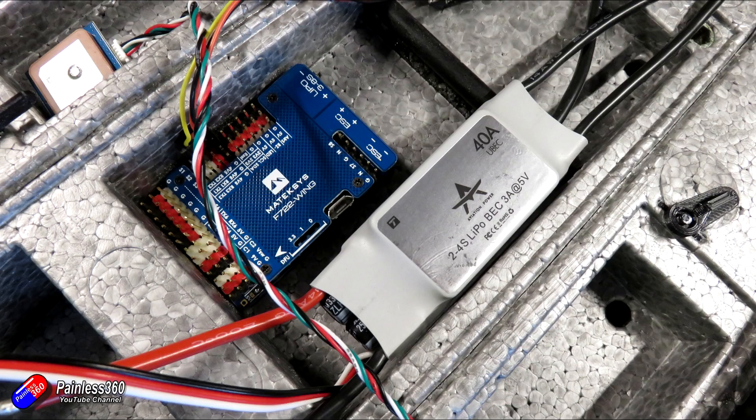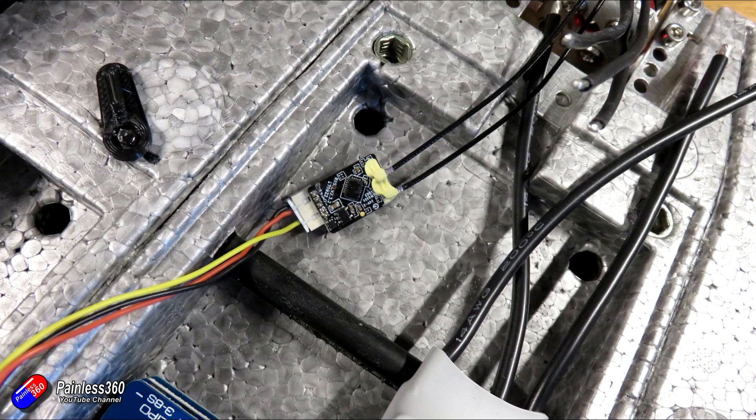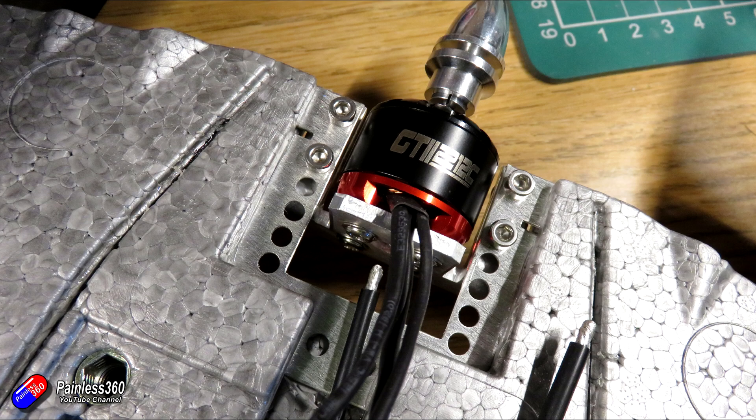Here's a close-up of the F722 with the 40-amp speed controller by the side. With a little bit of clever cabling, that ESC can fit a lot further forward. The GPS could potentially go in this position — either side would do. It may actually be decided by the cable that goes from my antenna into my video transmitter. The receiver could go at the back, but I don't really want it there — I don't want the antennas too close to the prop, since landing in grass could sweep them back into the props. And obviously we've got the camera at the front. The motor is one of the few things I can't move; it needs to be in this position to give enough distance between the prop and the back of the model.